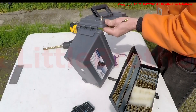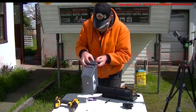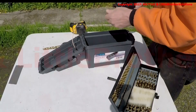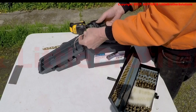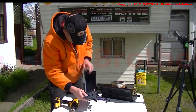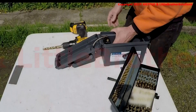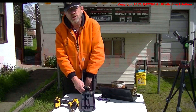Lock washer that came with it, and it looks like that hole is just right. I'll tighten that down with a wrench and keep going here. The radio needs to be screwed onto the end of the cable, and then we're going to try and determine where that radio best fits. You don't want the cable being stretched too much. That way looks like the best way, so I'm going to put the radio in here like this. I'm going to use a piece of cardboard behind it to hold it, and a piece of foam in the bottom to set the radio up some.